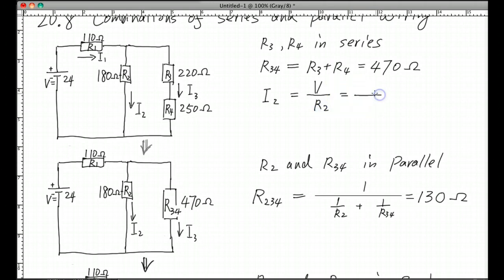Can I do this? So how much is the V? V doesn't change, it's 24. Why do you think it doesn't change? Why do you think you can use the 24 and then divide by 180? Is that what you're thinking? That's total. Okay, now I can tell you this is a common mistake. So this is wrong. I'm going to see this over and over again on the quiz test. A lot of people always think the voltage is the same. No. Okay, the voltage,